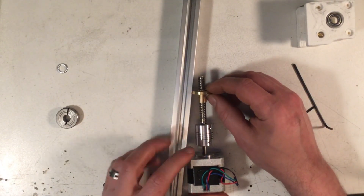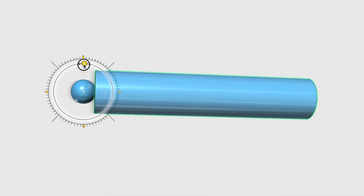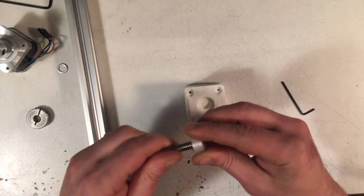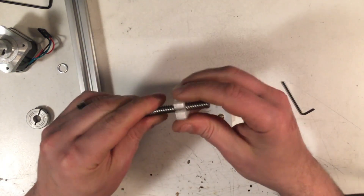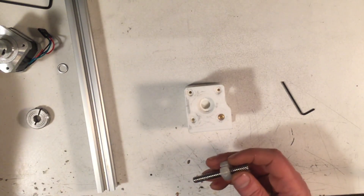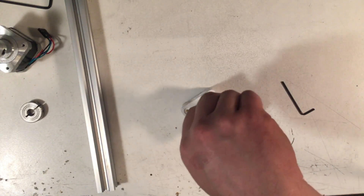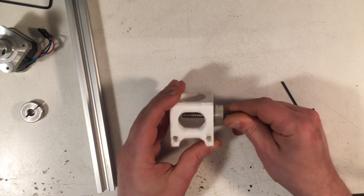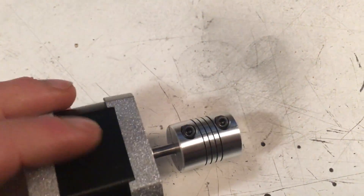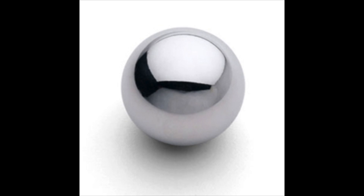It's not a perfect solution and you absolutely should make sure everything is aligned before you go to things like this. But as you can see, it will help when the angle is goofy or you're a little off kilter. And if you do find yourself needing a lock collar for these Acme screws, here's one that I 3D printed — I'll toss a link up to the Thingiverse file. That works pretty well and it's free, as opposed to these collars that start at $12 and go up to $100 for the precision ones. I'll post links in the comments to these couplers on the OpenBuilds parts store and Amazon. Ball bearings I just get at the hardware store for about 20 cents.